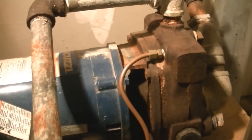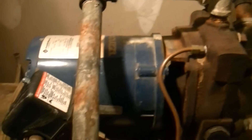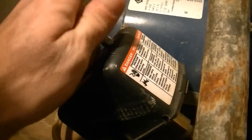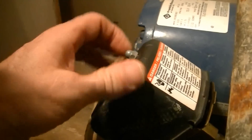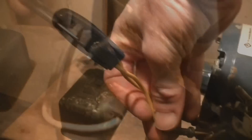This is a jet pump — the type you use for a sand point. Always had good water here with this. I've already shut the power off. I'm going to take the cover off. I've got my electrical tester here — just going to make sure there is no power. No light on there, good. The problem with this switch is it doesn't have a secondary adjustment on it.